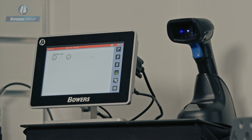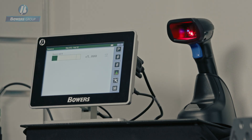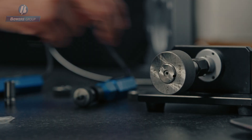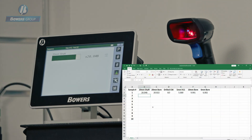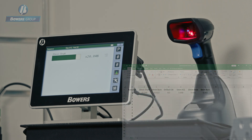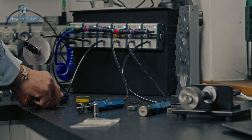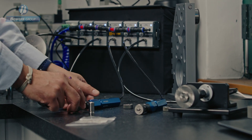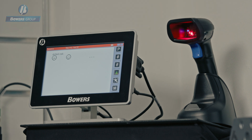One part of the sequence is a manual input of a visual check — it's looking for a drilled countersink, which I'll confirm as being present. Moving on to the final two measurements. When I've completed the part measurement there's a summary screen which shows all of the results and confirms they're all good results within limits. If I hit okay at that point it will transfer the data to an Excel spreadsheet. We're now on part number two of two, going through the same process cycling through each stage of the check. On the visual inspection this time, it's looking for the drilled countersink — I'll say that it's not present, so we get a no-go result in this case.